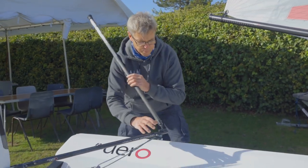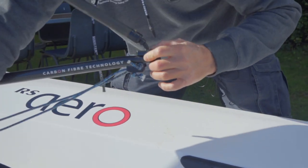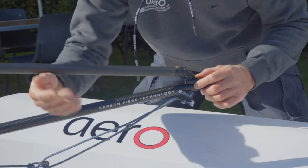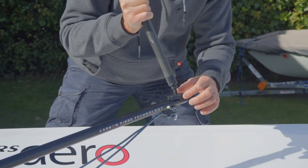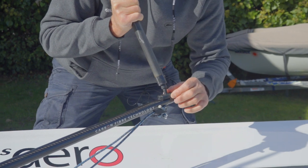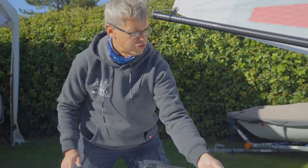Moving forwards, very important — a little bit of tape around the fitting here. They don't normally fall off, but they will fall off once in a blue moon, and it will be just when you don't want it to on a windy day when you take a snatch on the tiller. So just two wraps of tape is all you need for security of keeping your tiller extension onto the boat.